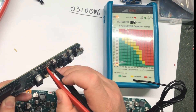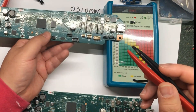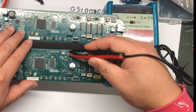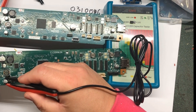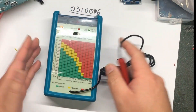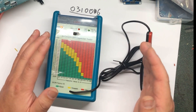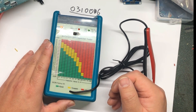There's one more. So we have this one's bad, this one's bad, and this one's bad. Let's compare them with a good board. Overall this tool can really save your time. I've seen other in-circuit capacitor testers where you have to do calibration and reset it every time, but with this one I spent less than a minute to test the whole board. So you have one, two, three bad capacitors identified. I hope you enjoyed this video. Visit us at www.bchtechnologies.com or locally at Greensboro, North Carolina. Cheers.